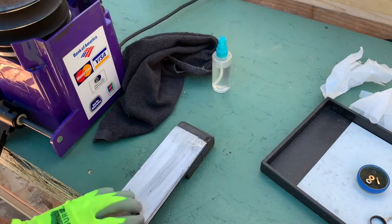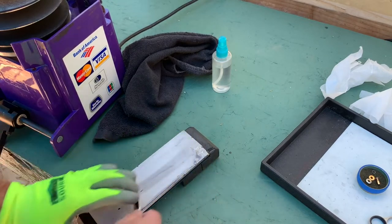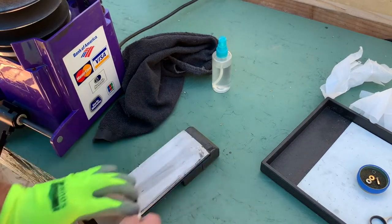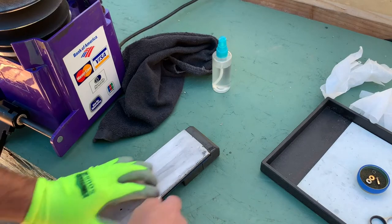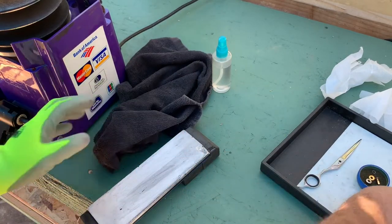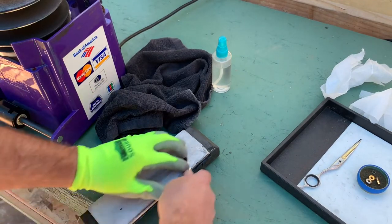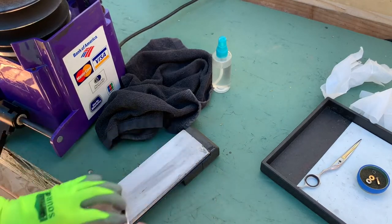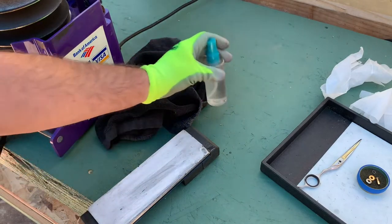You know, there are little tiny pieces of metal fibers on top of the water stone, and that puts little gaps that I just do not want to rub the beautiful new sharpened blade back over. So by keeping it one direction, it rolls the little tiny metal deposits away from the blade. Each stroke is rolling away from the new edge I put on there, not going against it.